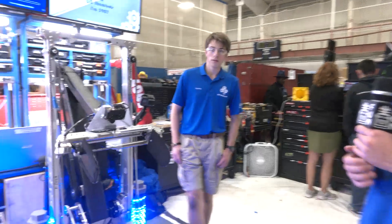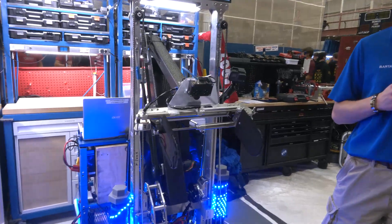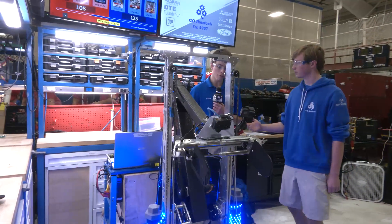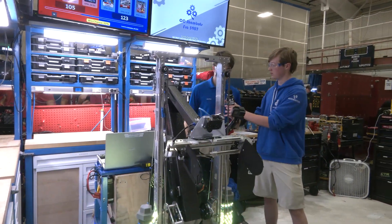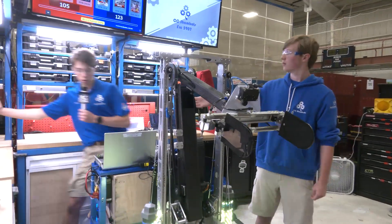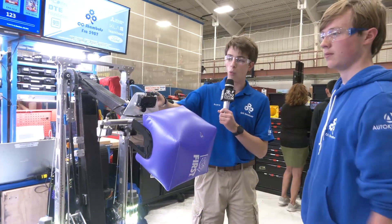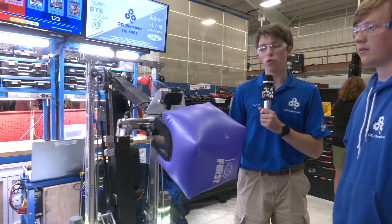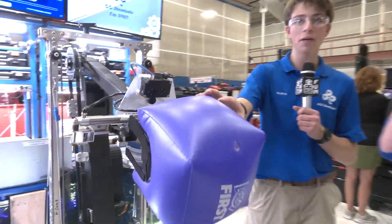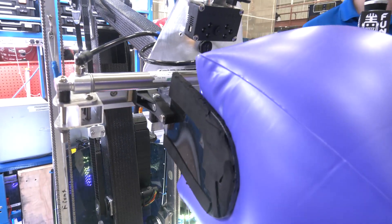Jacob, talking about acquiring cubes and cones — we see some demos of different positions as well. We primarily pick up from the shelf when we drive — this is our shelf intake position. One of the big things we did was put a proximity sensor on our robot so it can tell when there's a cube or a cone there to successfully grab. We've iterated on that several times, bringing it down lower to see cones more accurately, giving us really reliable pickups — just driving up and picking it up, even though we only have a pneumatically actuated claw.